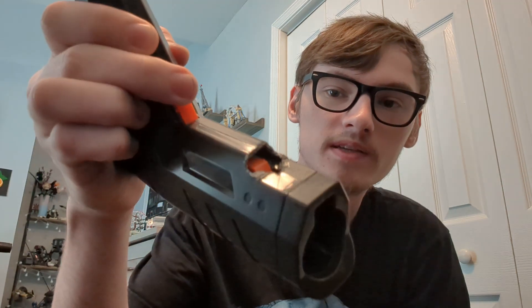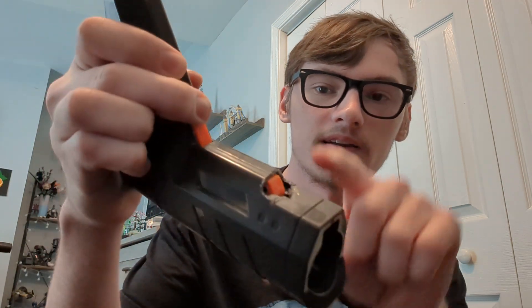Don't do that, at least not with the stock that this thing comes with. Because the Nexus Pro X stock works differently than a regular buffer tube stock. The little piece right here — as you can see, I had to cut it open — there is a small lip that protrudes off the bottom of it that catches on a small shelf that's on the buffer tube.